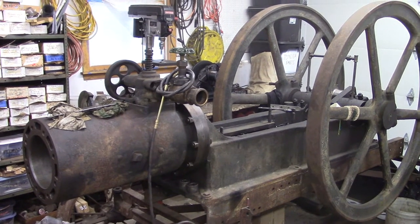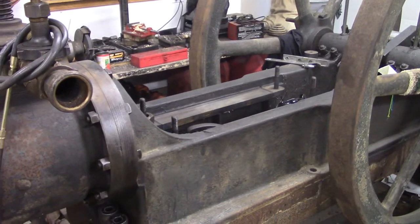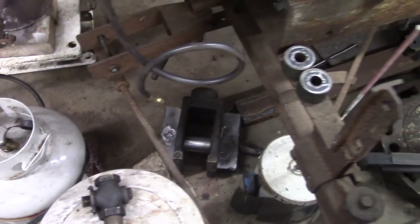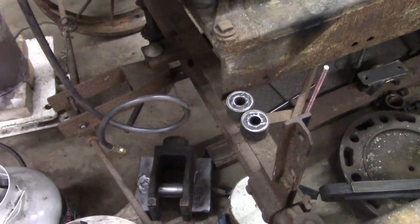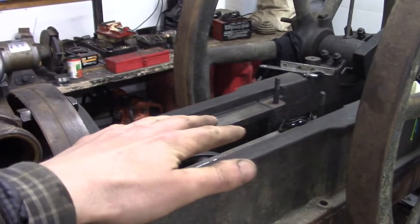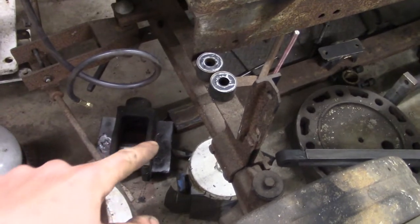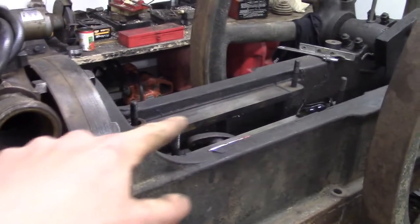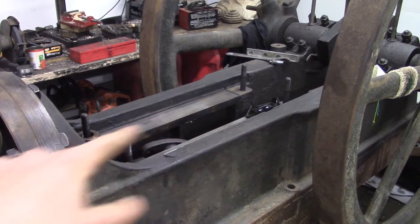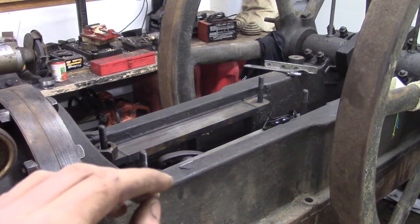The next couple steps kind of go hand in hand. The last thing I did besides the intake was pouring the crosshead. I cleaned it up, cleaned up all the excess stuff that had seeped past the damming. The last thing I need to do is put that on the crosshead guides, run it back and forth a couple times, find the high spots, and scrape the high spots. I don't want to mess with the underside bearing too much — the side that addresses that surface — because if I scrape away too much material, it will sit low and there is no way to shim that guide rail up. So I really don't want to mess with it too much. I just want to kiss off a high spot or two if there is one.